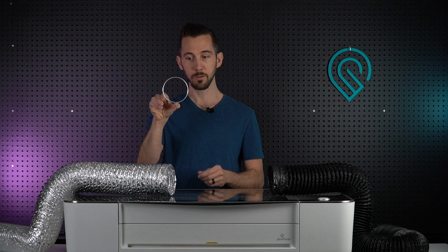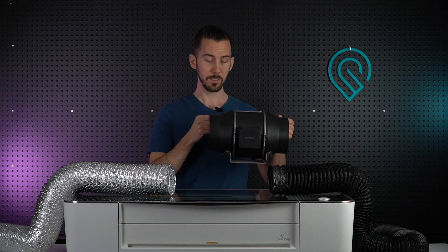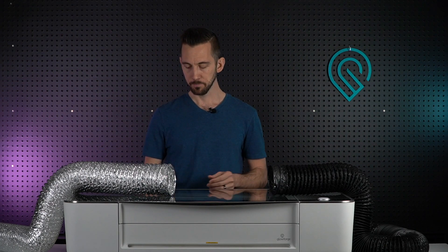I've been using spring clamps the entire time I've used my Glowforge. I've never used one of these screw clamps that you tighten with a screwdriver, and I don't need to because I have a tight connection at every single point — from the hose to the back of the Glowforge, to the AC Infinity fan and the reducers I've created. The exhaust adapters I've created have a tight seal to begin with. And if there's one thing to take away: no amount of clamping or taping can make up for a poor connection. You need to start with a tight mechanical fit.